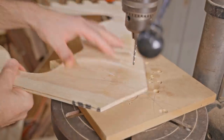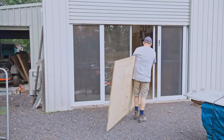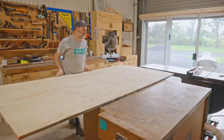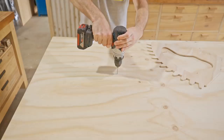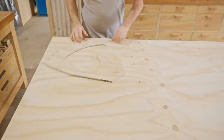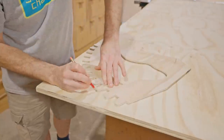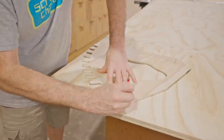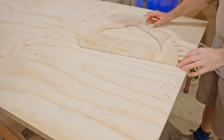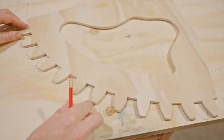The template's ready to use, so I'll grab a sheet of three-quarter inch plywood that's been stored away in my lean-to for about five years and we'll get started making it. The pivot point needs to be very accurate and just the correct distance away from the teeth — if the circumference isn't quite right the teeth won't line up when I get back around to where I started, and when I did the small test cog it took me a couple of goes to get that right.